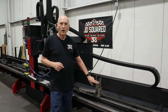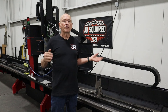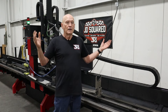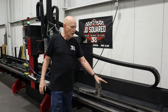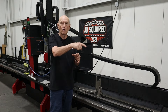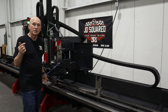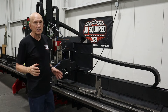We make all of our plates out of three-sixteenths inch stainless steel. However, you can make your own out of anything from eighth inch up to maybe quarter inch mild steel or stainless, whatever you have laying around. If you want to make a custom plate for, say, one-by-three tubing and you don't want to wait on us, just go ahead and make your own — all of our XRs have the ability to cut flat plates just as well as round and square tubing. You can go to www.jd2.com and obtain the actual drawings of these parts — go to the support tab, head down to XR, and look for the lifters. You'll be able to get those plans right there and make your own.